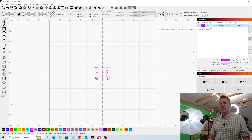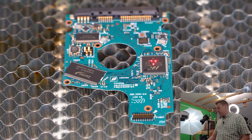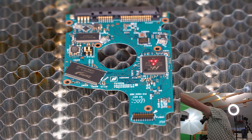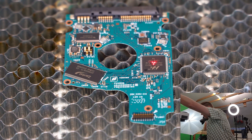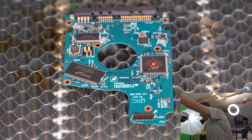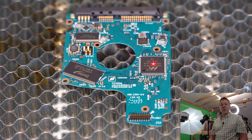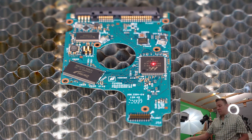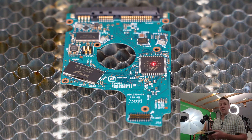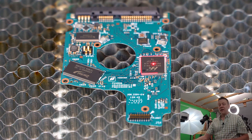I do have the mode set as fill. When I power up the machine you'll see that I've got three little laser dots on the top of that computer chip, and that is to set the focus on the machine. I can turn the top crank to adjust the entire laser head up and down, and when all three points converge into one the laser is in perfect focus. When I ordered my Cloudray machine I ordered mine to come with a foot switch, and when I click it once it will automatically start framing out the project. If I click it again it will start running the program.